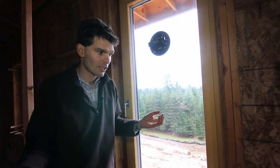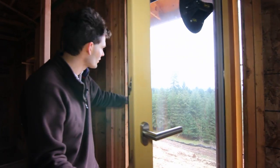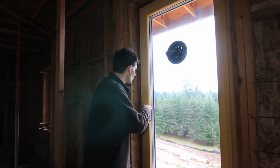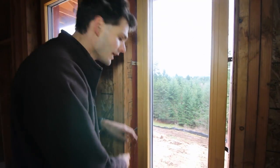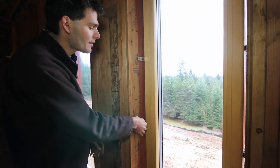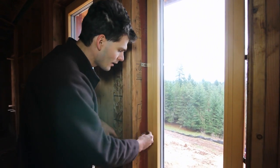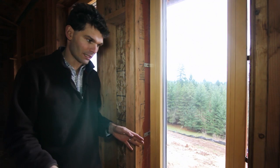When we're talking about the installation of fixed windows, we wouldn't be able to use the screws as shown because the screw heads would be visible on the inside. So instead, we use a supplied Z-bracket by Zola, as you see on this window. It's the same rough opening, just as a fixed window. A Z-bracket is fastened into the frame from the side with two head screws about one and a quarter inch long. The other end of the bracket gets screwed into your rough opening.